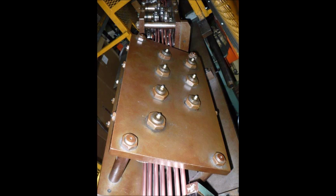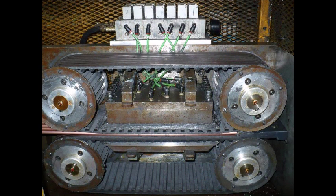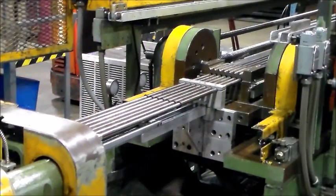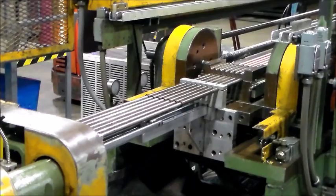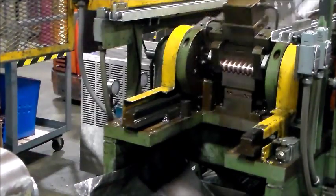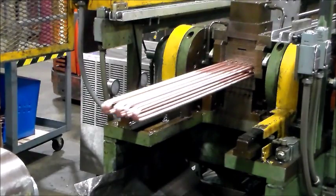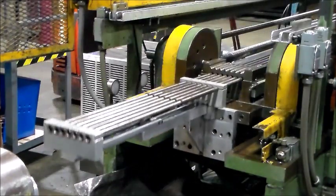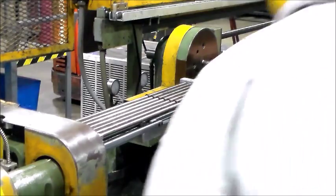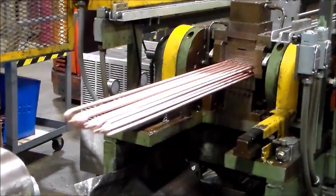The tubes are rounded before passing through straighteners until they reach the feed belts. The feed belts pull the tubes into the machine from the switch tower to the bender side, where each tube passes through another tube guide block before reaching its own oiled mandrels along the stripper rods. These mandrels make sure the tubes will not become misshapen when bending. The tubes are clamped on one end, cut on the other, then bent by the bender carriage on the clamped side. Once bent, they are stripped back off the stripper rods and dropped below to be checked for quality before being sent to the next area.